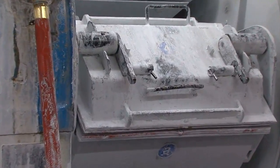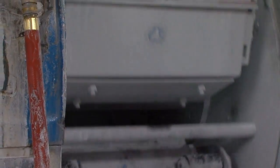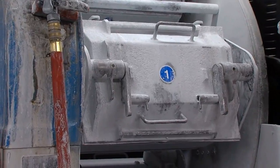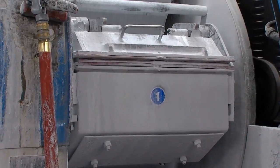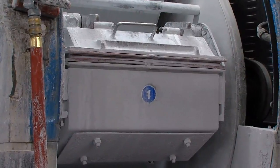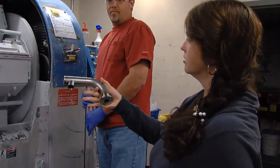We've got four different barrels — if you want to rotate them, this is very slow motion but it gives the demonstration. Those spin while the drums spin in the other direction, all at the same time at a very high rate of speed, and that's what creates the 10 to 15 G's against the parts.